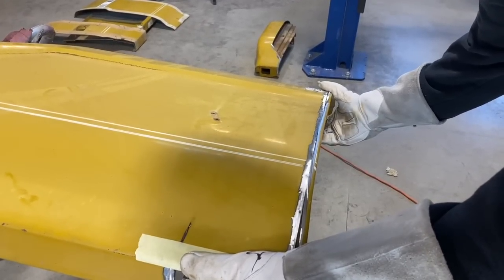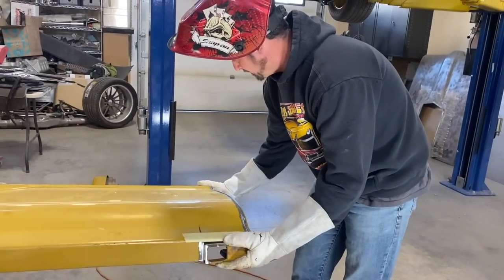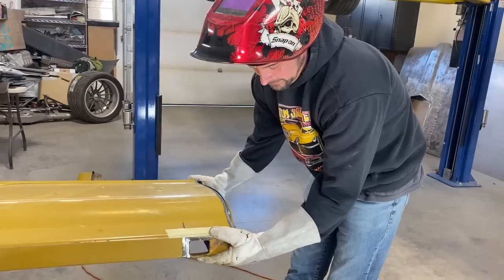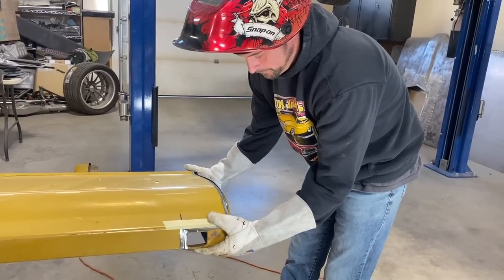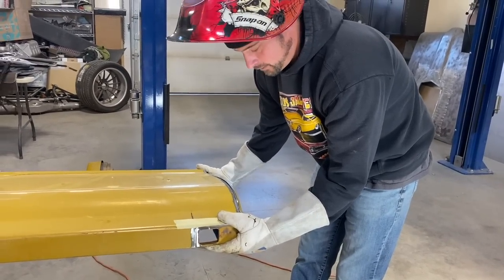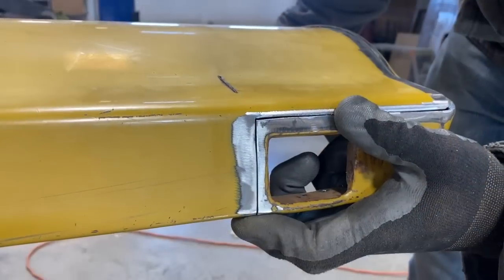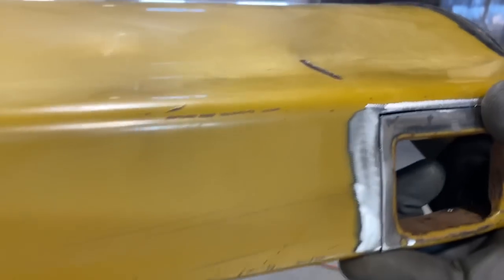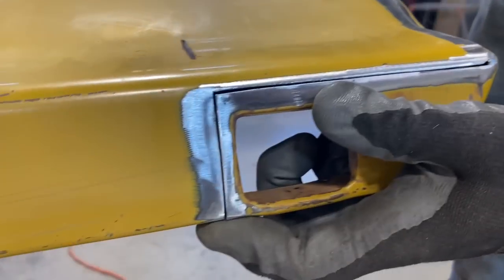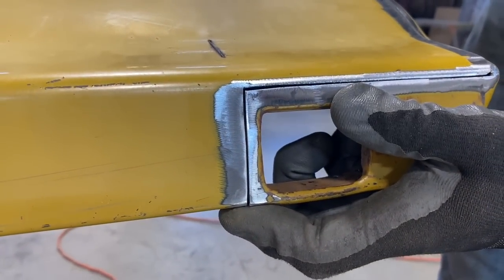There, that should do it. Still needs a push top and bottom because it's still warped a little bit. What I'm gonna try to do is start it clean in the corner, the upper corner, and then David and I will physically bend the lower part into place as we tack it. Here you can see just how nice our fitment is before we even start tacking to go on to welding. We're gonna put this piece in place for now and get started.